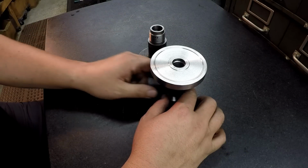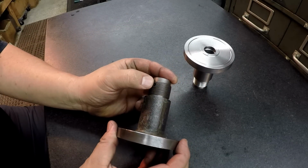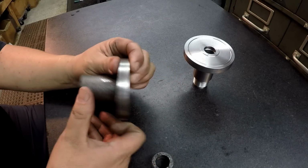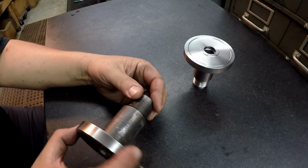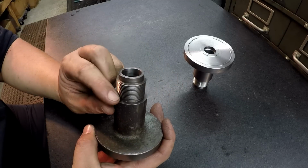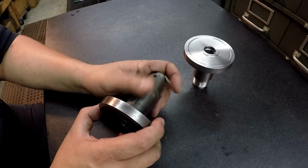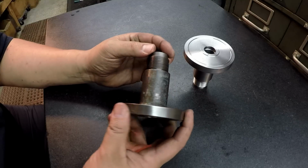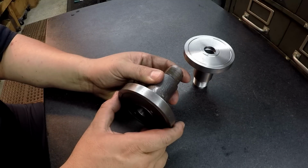All right, so what I've been thinking about here is we have our hole. That's probably an oil hole since it goes into that groove. And then we also have our 0 mark there, which is going to be for your collar. So when this thing screws into the machine, and I'm assuming that's how this gets screwed into the main part of the carriage of the lathe, it's going to shoulder out right there. So what I'm worried about is, if that's the case, whenever this thing is screwed in there, it needs to be timed properly. When you look at this 0 mark, it's actually 180 degrees away from that hole. So that's telling me that when this thing screws in, your hole should be at the bottom, and when you lock this thing in, your 0 should be at the top.